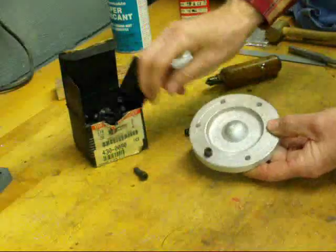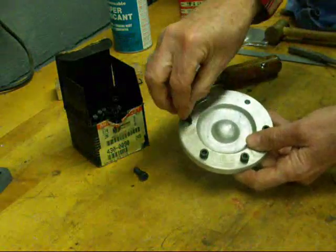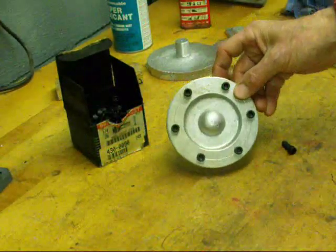And then see the caps — these are clearance holes, these are the quarter inch clearance holes. So in a minute I'm going to show you how to transfer these onto the cylinder and drill them out and tap them. That's what it looks like, and they're nicely spaced.